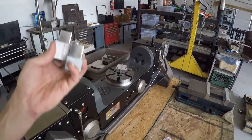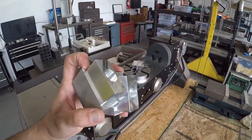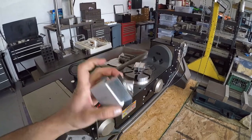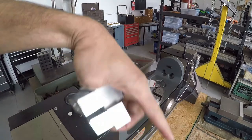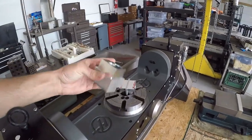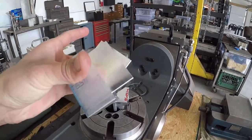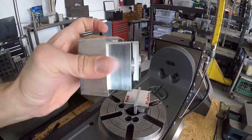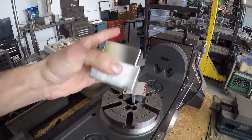Maybe I'm just not pushing the tools hard enough. The thru spindle was kind of useless for everything but the facing, since I don't have the right kind of collets to make it actually shoot down once the spindle gets going. It just flings all your coolant where you don't want it, on the walls. But it seems like anything but nothing seems pretty good, at least for this anecdotal test that means nothing. So here's some beauty shots.